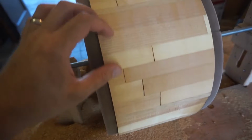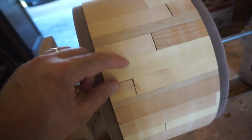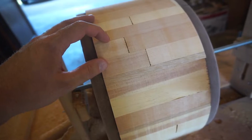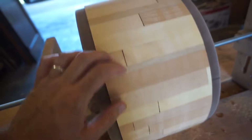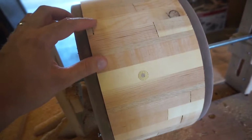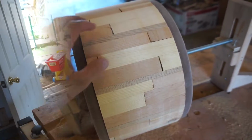Okay, two passes done. It's almost the right thickness, the right diameter. You can see even more clearly now all the problems with the wood, the way it was originally joined together. So what I'm going to do, I've got some clear epoxy I'm going to mix up. I'm going to basically putty knife it into those voids. I was thinking about mixing the epoxy with sawdust so that I could make those disappear more. But you know what? That's an artifact of the doors. Why not preserve it?